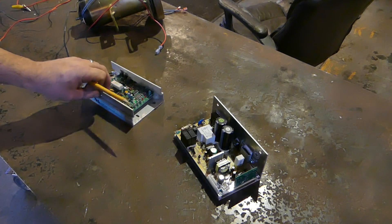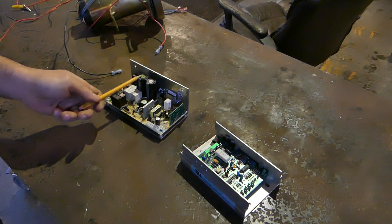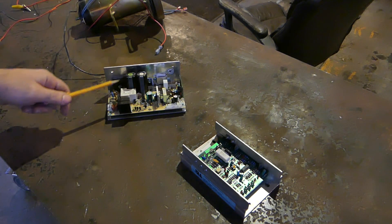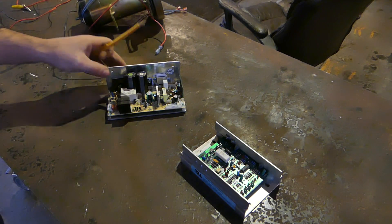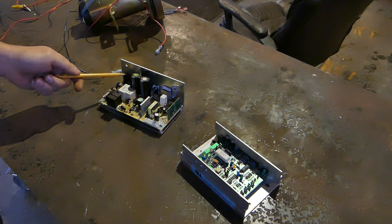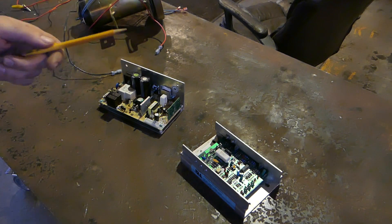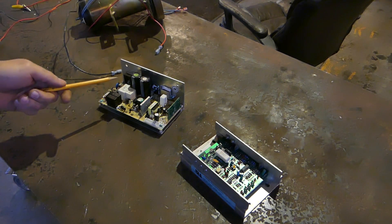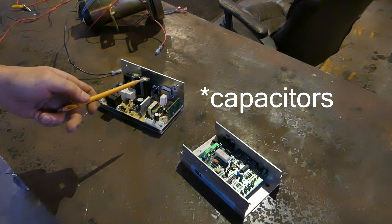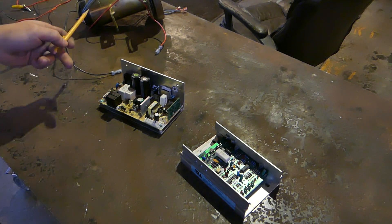You can see some of the main differences between these boards. The first thing you'll notice on the MC60 are these large capacitors — they're in parallel, and their presence tells you there's a full wave bridge rectifier. The alternating current from the wall comes into the bridge rectifier where it converts to a full wave pulsed DC signal at 120 Hz. It then passes through filter capacitors that smooth out the pulse, and eventually moves on to a pulse width modulator. By varying the pulse width, that's how you control the motor.